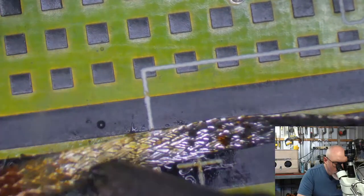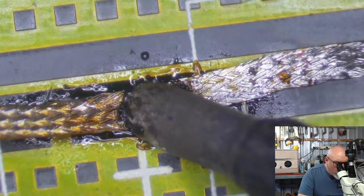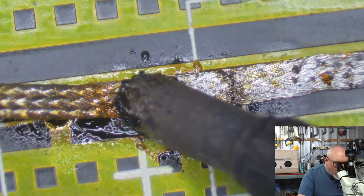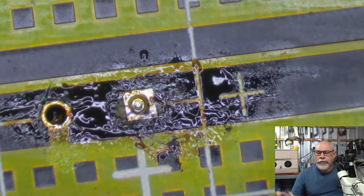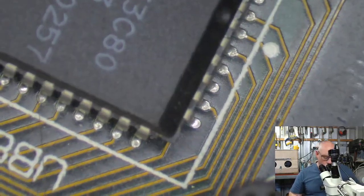Yeah. Come on. When you finally get the hole clear, you often see it, because you just see the wick, solder wick, suddenly go shiny, and that's as it's absorbed all of that solder in a rush. So we're going to flip him over. Actually, I might just try these holes here from the other one. These boards are so big, they're annoying. How frustrating.